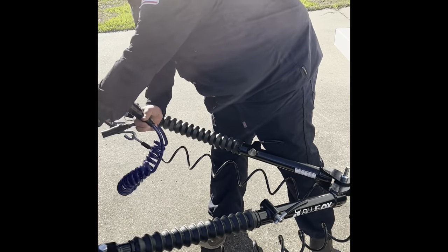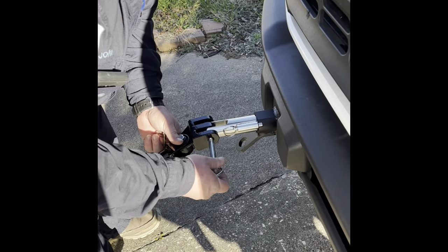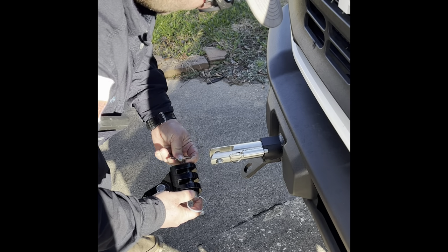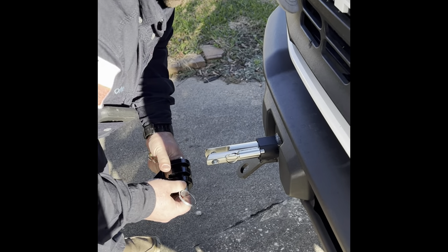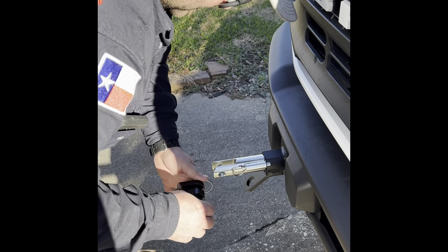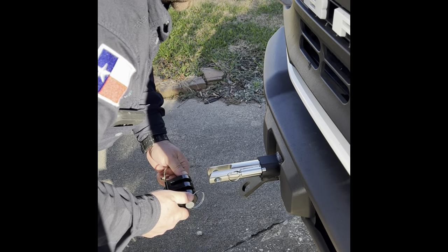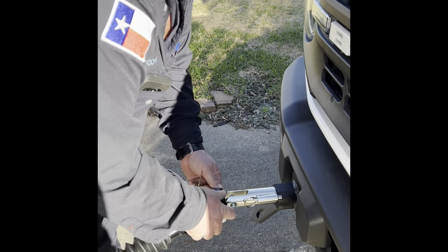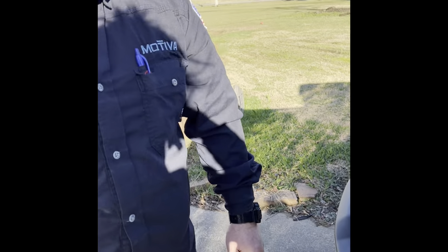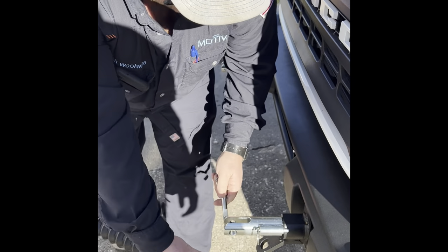So we're connected. For the safety pins, always put them from the inside out — if something were to happen, the pressure is going to this side. If you put the pin to the outside and the pin breaks, it may work itself out. But if you put it to the inside and the pin breaks, it's going to keep pressure going inward and keep it from coming out. That's what the YouTube guys said. Lynch pins — they come out too.